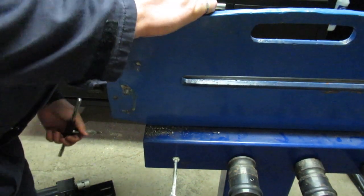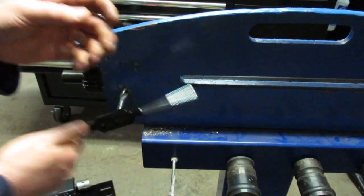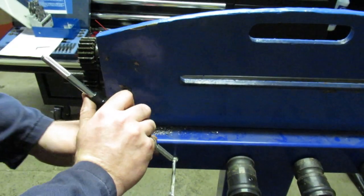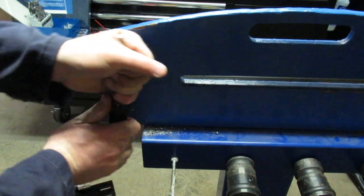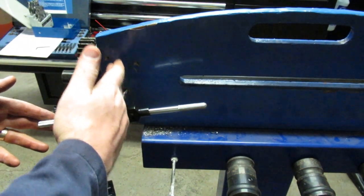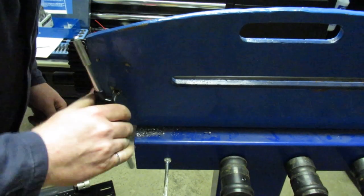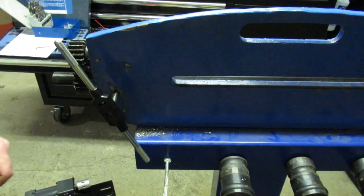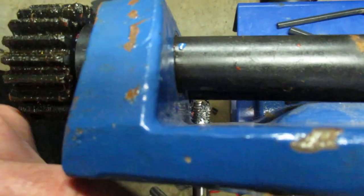See how they're progressing. So just about through now. Hopefully this doesn't bind up on the side where the end of the hole is and snap the end of the tap off. That's the problem if you drill a hole and you're partway into a thicker material and a thinner material. That's a real possibility. But no, I'm through. I'm okay. See if we can show you that or not. So I've got plenty of thread through there. Should be okay.